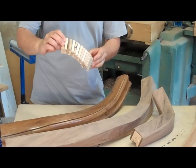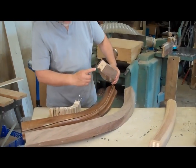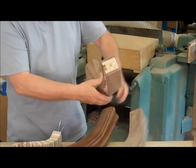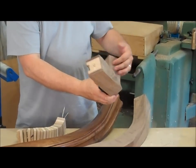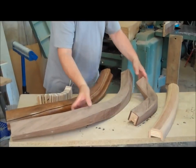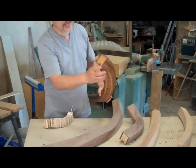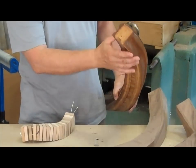Once the shape is fixed and taken off the metallic rail, I take the heart — this is the heart shape — the wood which has taken the shape off the metallic rail, and I glue veneers around it which give me a thickness of wood which can then be moulded. This gives me the square section, which is the starting of the stair and is ready to be moulded. Here's a quarter turn which is also ready to be moulded, and this is a moulded section of the same sort of rail. You can see the outer layer of walnut veneers that has been built up to enable us to do a moulding and give it a nice smooth finish.